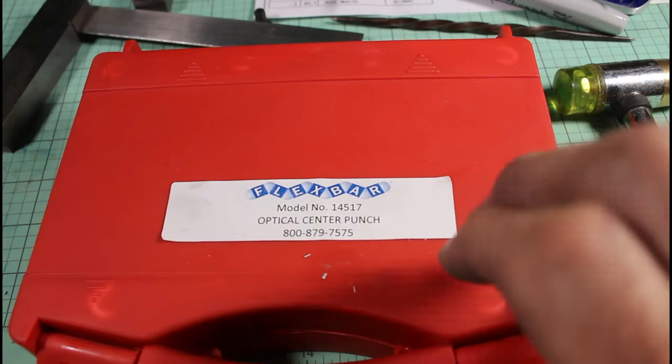So on the mini mill, I've drilled and tapped a screw into a piece of MDF that I've clamped down, and now I'm going to drop that in. And then this is going to be the pivot point for this movement here. So hold on a second, let me get that tightened down. That's good and snug. Okay, now I'm going to lower the mill head into the starting hole, which I already drilled. Right there, now it's bottomed out. It's actually cleared through there.